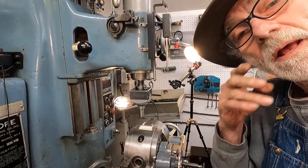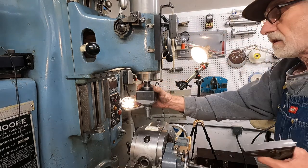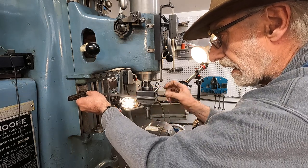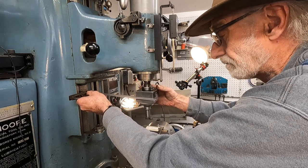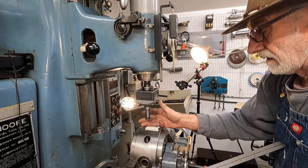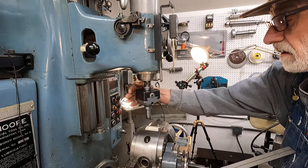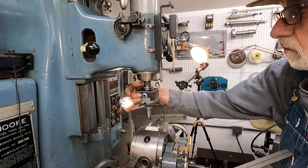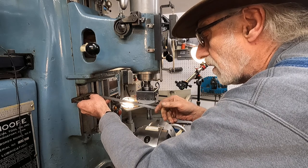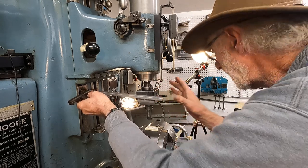Yeah, I think so. Now, when setting up a boring machine and a jig bore, you can square the head using the vertical ways. What I've got in here is a square head, an old Criterion. So you can center the machine. I've got a mark here, and I'll show you that. First I'm going to square the head, turn the dial towards the machine and have the cutter facing me. It's just easier. So, here's number one. Square that head with the machine.